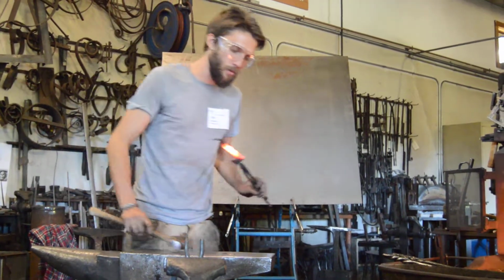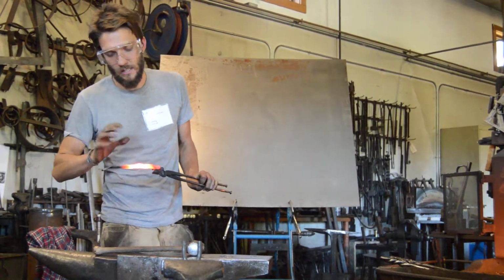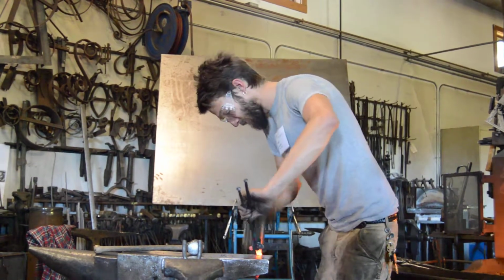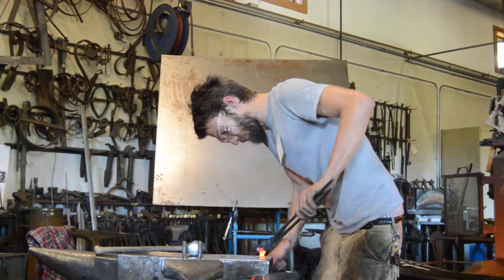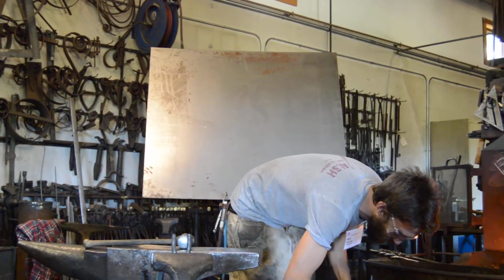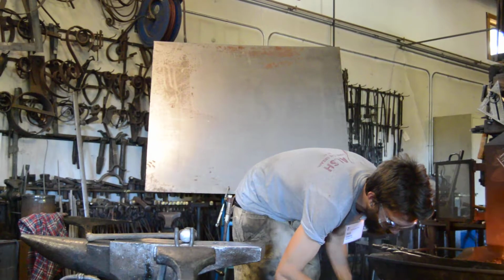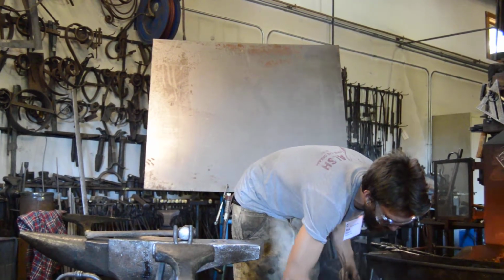So now that I've got a couple of welds on this, I'm feeling a little bit more confident about the stick, and I'm letting it descend into slightly cooler temperatures. And as always, I'm working it square, and then once I've reached my parent bar dimension, I will work it round, or work it octagonal, and eventually round.